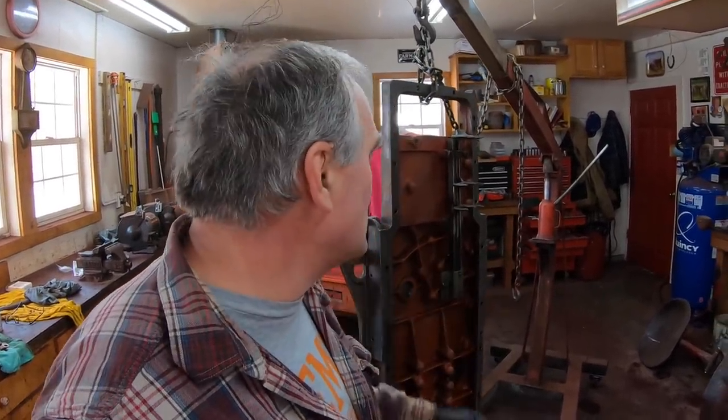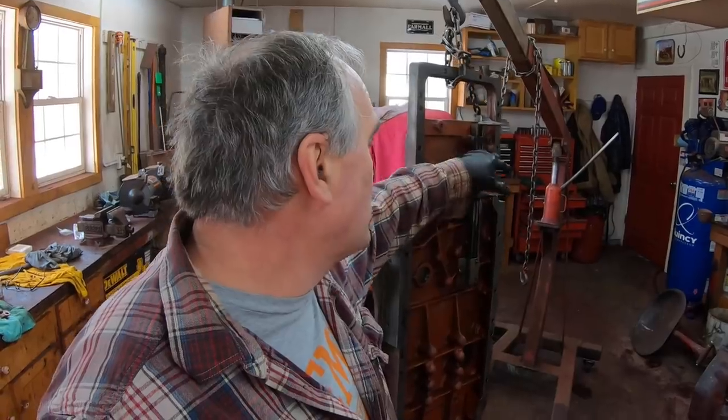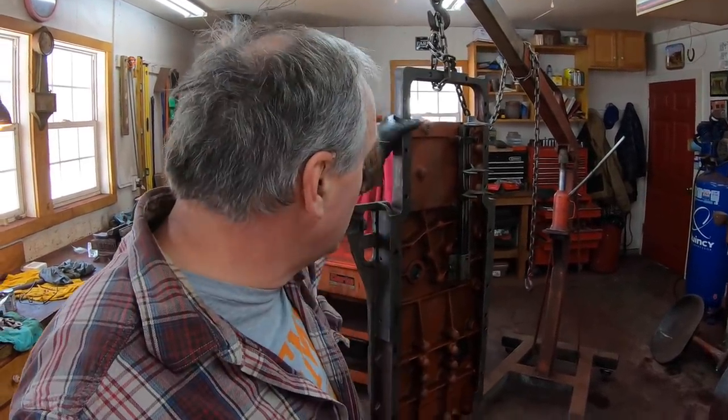It's super simple. Now, I decided not to take this apart because everything feels solid and fine. The detents are really strong. The shifter forks look fine. There's not a lot of wear in the paddle at the bottom of the shifter. You can tell if you get a lot of waggle when it's in gear, that paddle needs to be built back up with weld. This one's fine. No reason to take it apart. So I cleaned it up as is.